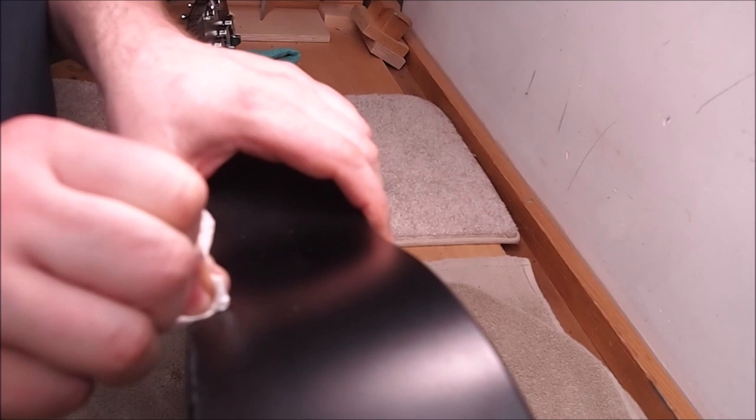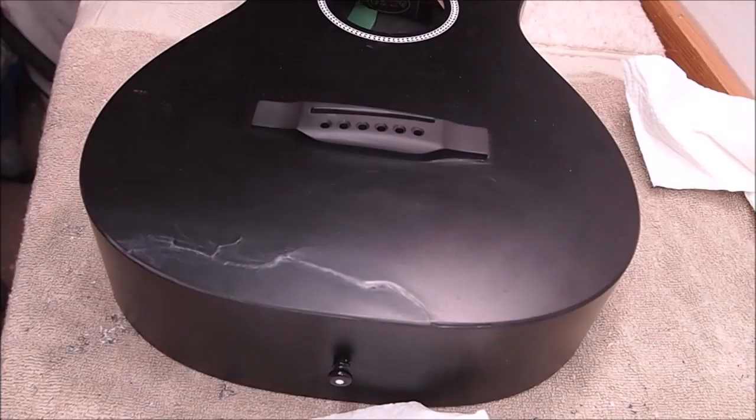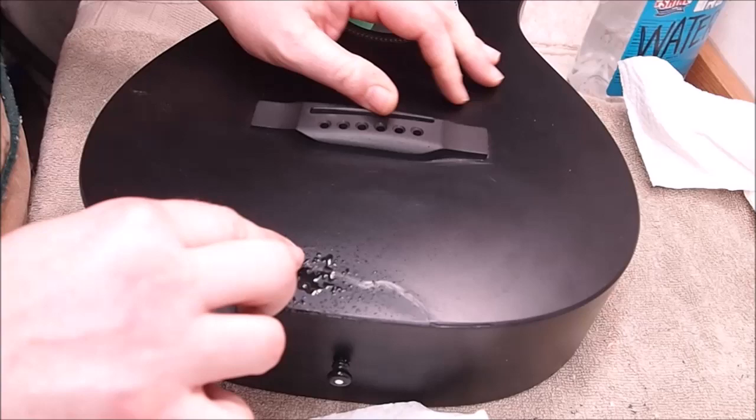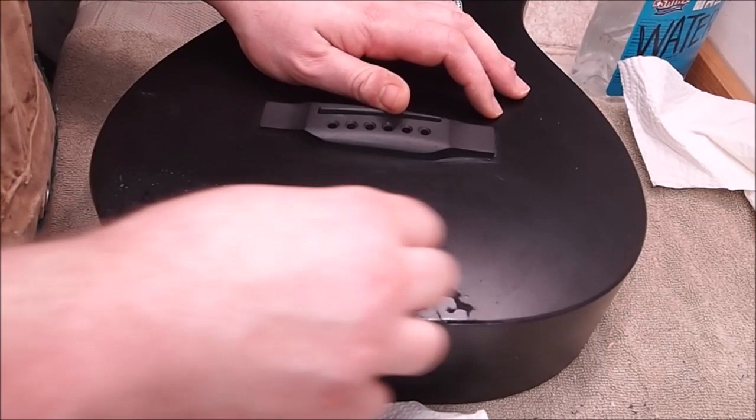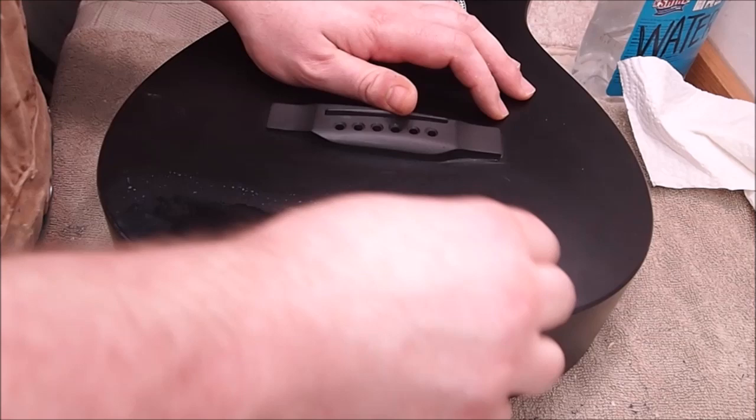This laminate is so tough and so slippery that with a little bit of naphtha I can actually scrub off the epoxy residue. I used a couple of coats of super glue in and around the crack to fill and level the area, and I scraped it flush using a razor blade. Here I'm using some wet-dry sandpaper up to 1200 grit, which approximated the low sheen on the rest of the instrument. There's only so much time for this kind of work on a job like this - I can't charge too much for it, so at a certain point good enough is good enough.